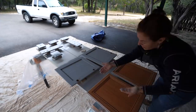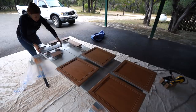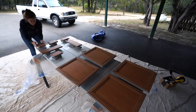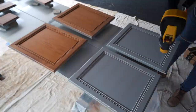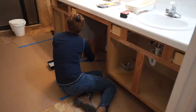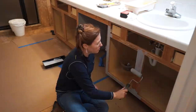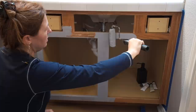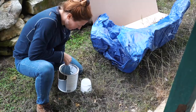As I'm going through and flipping the doors, I should save doing the edges for the second side because I'm just leaving fingerprints — so you can learn from my experience. I always start with whatever is going to be the underside or back first, since it will have three pinpoints from being flipped over. The sprayer makes quick work of this job. When spraying to get into all the nooks and crannies, choose a direction on your first pass, then do the opposite direction on your second pass. After the doors, I switched to a brush and roller for the body of the cabinets. I'm using a microfiber roller because it leaves a smoother finish, though if it's not smooth enough you can back-brush with a paintbrush. I called in my mom for reinforcements, which adds a little fun to a job like this.